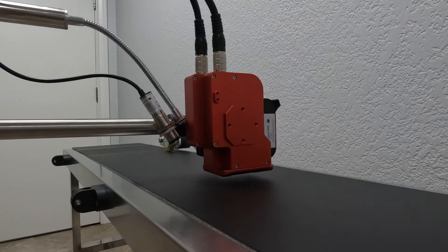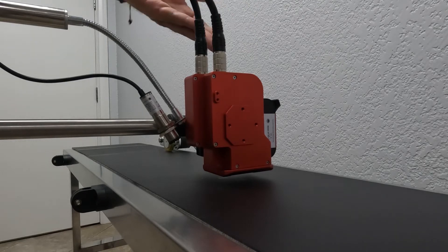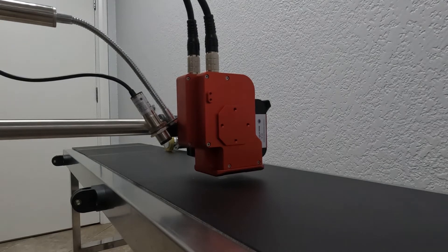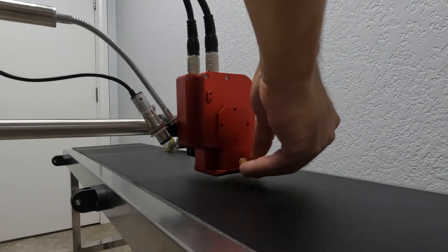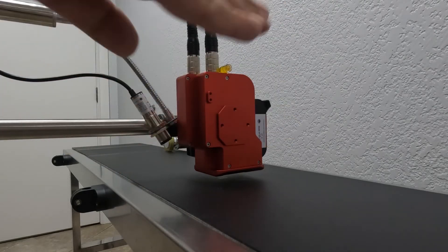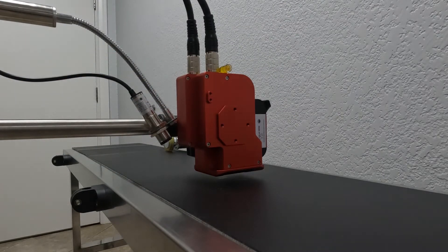To start, the most important thing when stitching your printer is that the printhead itself is level on all axes. I have a small level here and I set it right on my printer to get a feel for whether it's level in this direction, and then I also set my level up on the top to make sure it's level there too. This is very important to make sure that your two printheads line up together correctly.